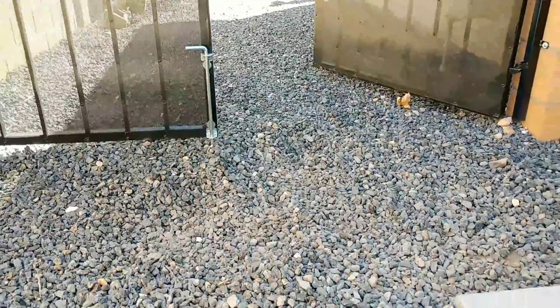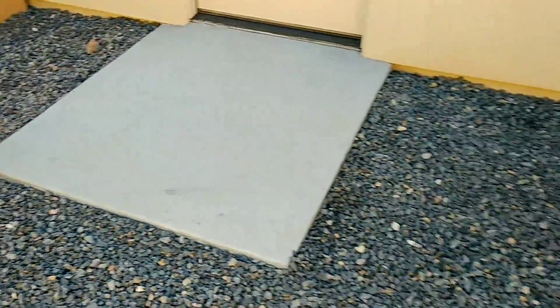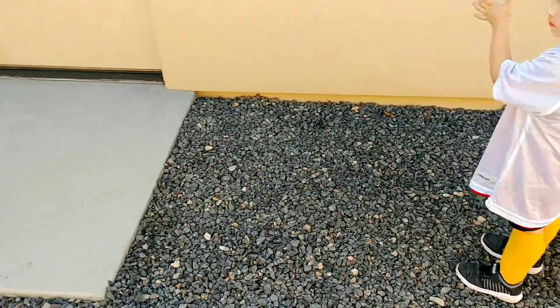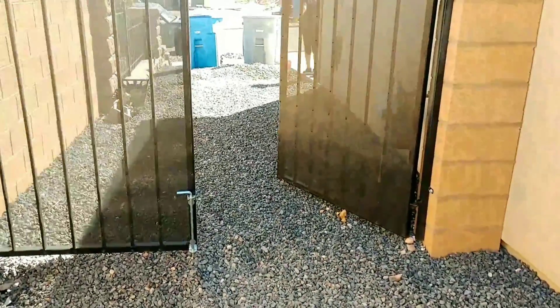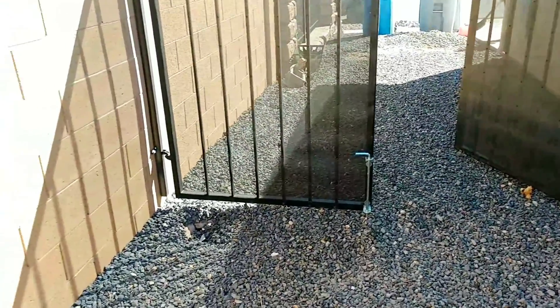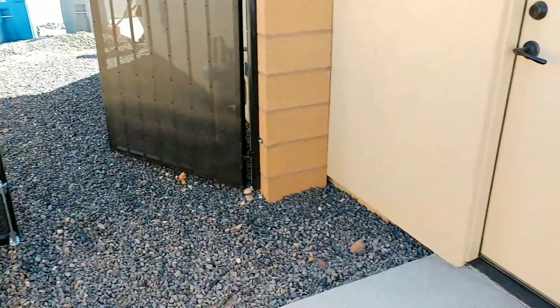That valley is also going to have to be sloping towards the street. We'll probably slope it all to the front yard — that way you don't have to worry about anything flooding later, or undermining the footing for the wall, or getting underneath the house slab.